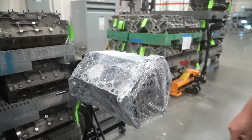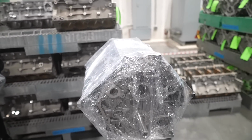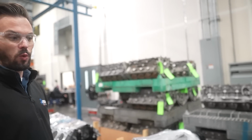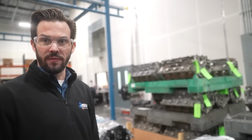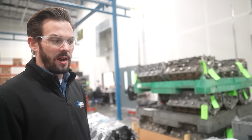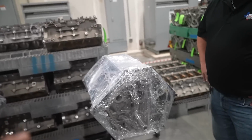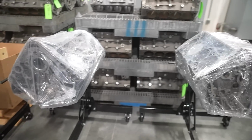I haven't seen one of these yet. Man, they really went to a pushrod V8. That's crazy. Power too. They do. Yeah, okay. So we have a stage 1 port on the factory cylinder heads with kind of a mild cam, not changing any of the pistons out with valve relief or anything like that. And it made like 702 horsepower. Wow. We've got our Titan intake on this that's in production right now. We expect that by February, March. It's not going to take a whole lot to make 1,000 plus on this engine. Man, small block motors are just killing the game right now. I can't wait to see what people do with those motors. Like seriously, that's going to be amazing.